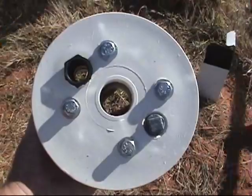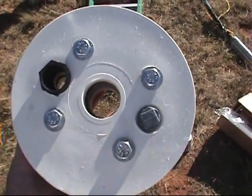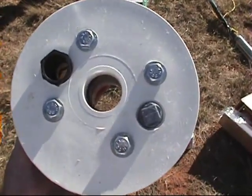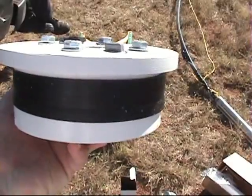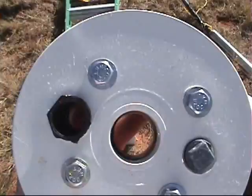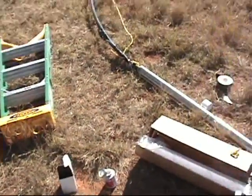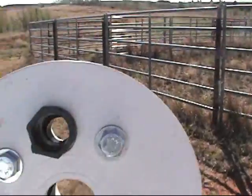What we have here is what's classified as a sanitary well seal. It slides down in the top of your well casing. These four bolts tighten and expand a piece of rubber to give you a good seal against the elements and insects. There are a couple of holes to bring your one inch pipe out and your wire out.